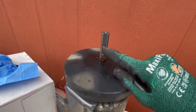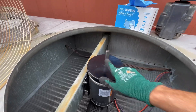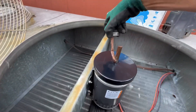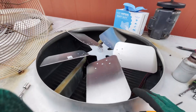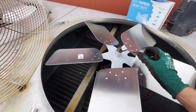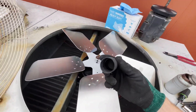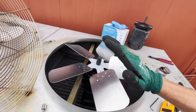You can generally see where your old set screws were, so that'll get you close. Always try to judge off the old one right where that's at. I'll throw a little bit of anti-seize on here and slide the blade over. After the blade is on, give it a spin to make sure it does not touch — you want it slightly above to pull that airflow right up out. Apply a little anti-seize on there and put the little boot on. There you go — got some vibration from that channel design.